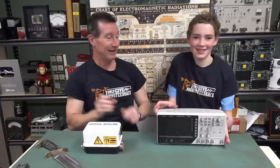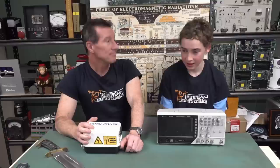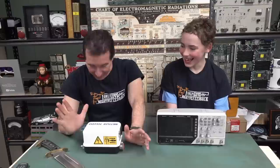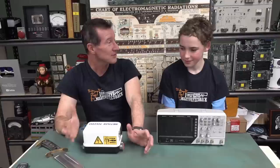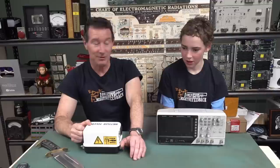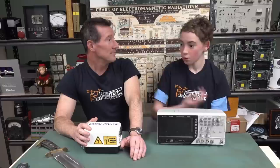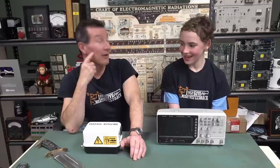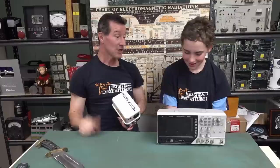Here is the scope. He hasn't got a scope now - how is he designing these boards without one? Most times the designs are quite simple and the datasheet covers everything, and as soon as he assembles them they work. I hope his next one fails so he can troubleshoot it with his new scope - that's when you really learn. His Ethernet one had issues with differential pairing, and he had capacitors and resistors for the USB signals which he removed, dropping it back to USB 2, and it worked fine. That was a signal integrity issue.